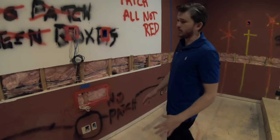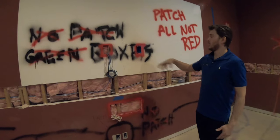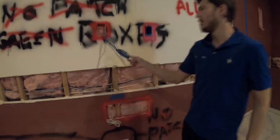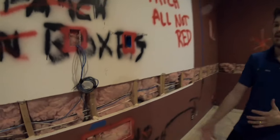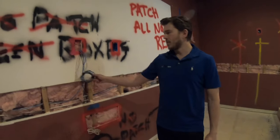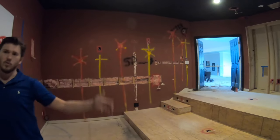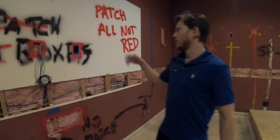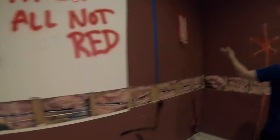Everything in red is going to be permanent and anything else in this room is going to be patched. We went above and beyond to make sure this customer is future-proof — we ran cat cable in case they want to do a Screen Innovations Zero Edge screen. On this project we're not doing it, but it never hurts to have ethernet in front of the room, and we even have that bypassing and heading all the way back to where the switches are, in case they want a switch that requires a hardwired ethernet connection. We're going to be putting in power here as well.